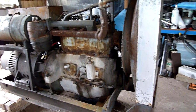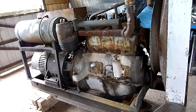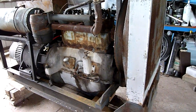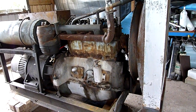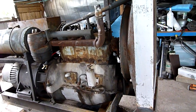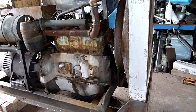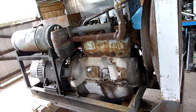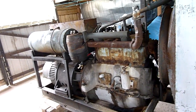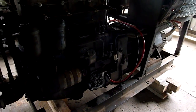There's a lot to be done on it — it's not in as good a condition as I thought. The whole brushes thing was a bit of a lie; it's actually got a burnt winding. It's still going to put out probably 415 volts between two pairs — it's just dropped a phase. It's not useless but it's not full three phase, unfortunately. It's still a really cool buy though; it's got a pretty stout little diesel engine, probably 1950s. The company Kemper pretty much disappeared in the 1950s and was bought by D-Mag.